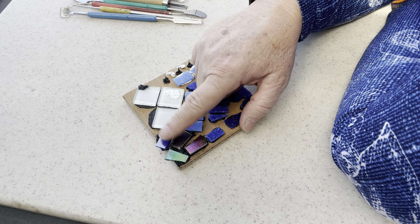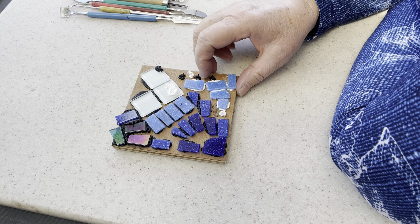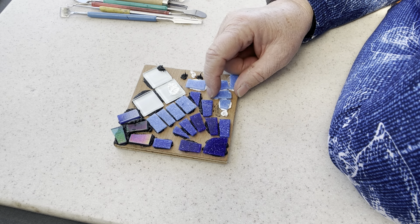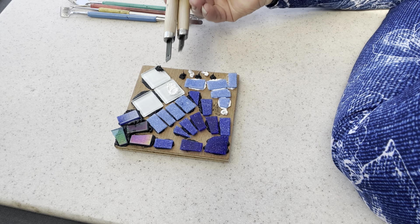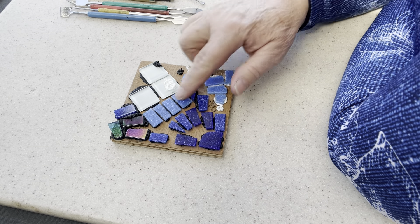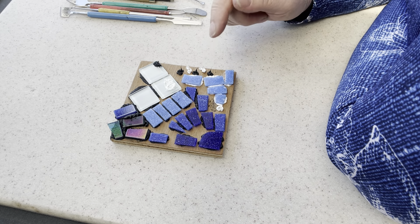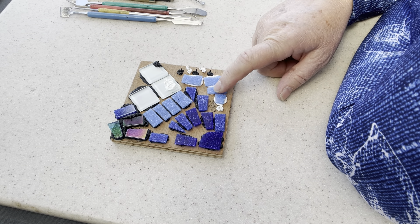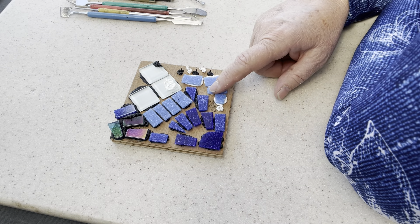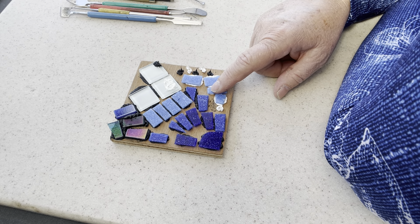So that's my main toolkit. Let's now have a look at this model — I've tried to make a really gungy, gooey mess here with some little dobs of glue in various places to see what we can do with it. This method works based on the type of glue — silicon glue. I don't think it would be so great with tough glues like liquid nails. I'm using roof and gutter, which is this black stuff, and the white stuff is marine flex glue. They're fully cured. When I look at the real-life example, it's a piece that's not fully cured, and it shows you how much easier it is to clean up within about 12 to 24 hours if your glue is a 72-hour cure glue.